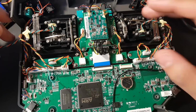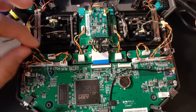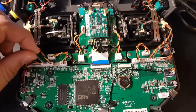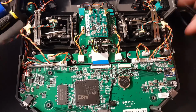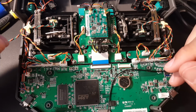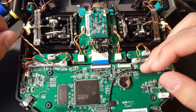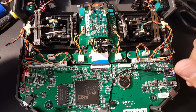So what I'm going to do is read the values of 0 to whatever many volts, so we can supply exactly that amount in here without worrying about damaging anything. Maybe it takes, for example, 2.7 volts, and I stuck in 3.3 volts. That basically blew out whatever's in here that's in charge of it. So I'm going to quickly figure that out from another one. I'll probably do it on this guy right here, and we'll get started. Let me prepare everything and I'll be right back.